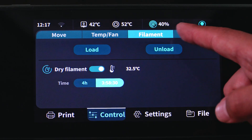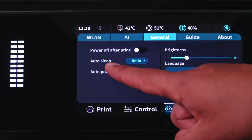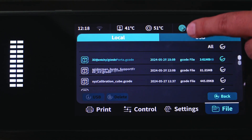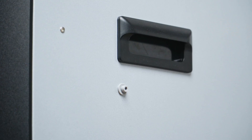As for flow calibration, I initially thought it was a pressure advance calibration but it's not. It prints some lines much like a pressure advance calibration in increasing flow, and a laser scans them to see where the optimal flow is. It then adjusts accordingly to your print. In general settings there is also an option to turn the printer off after a print job, and we have the usual file history like pretty much every other Klipper or Klipper-style printer. Going back to the dry box, it only fits one kilogram spools or smaller. FL Sun did add a little hole in the side with a short PTFE tube so you can use external spool holders for larger spools. However, this does bypass the filament sensor, so you can't use that with external spools.